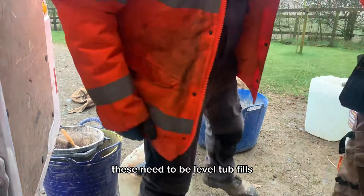So if you were mixing in a mixer, this would be pail fills rather than small tub fills, because you want a bigger mix. But the ratio will still be the same. And if the ratio is the same, your pointing will all be the same colour — if it's the same lime and the same type of sand from the same merchants, it'll be the same.